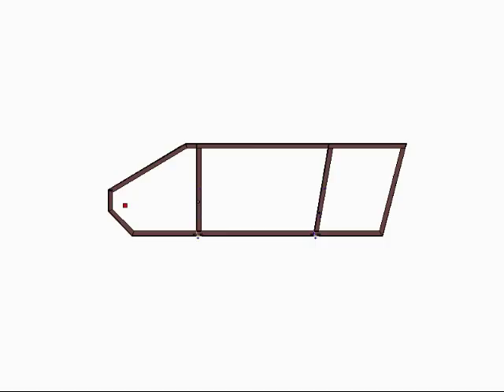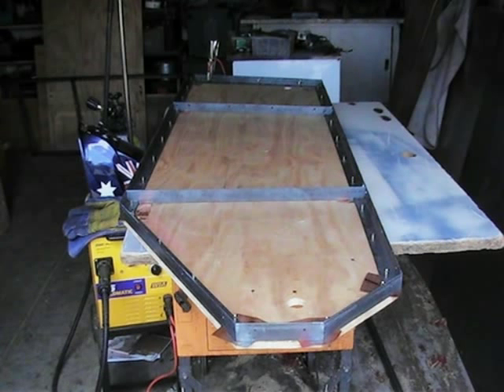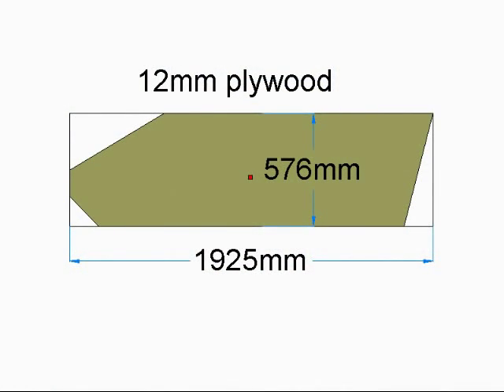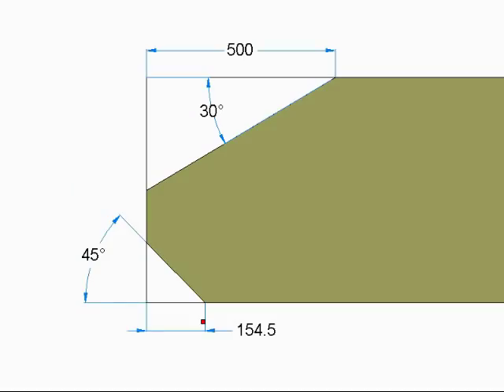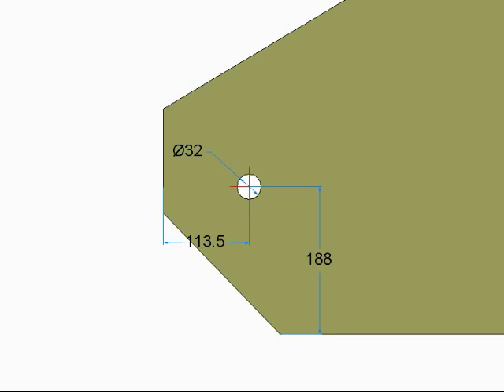In order to ensure that both side profile frames are the same and a mirror image of each other, you can always use the plywood hull profile panels as a welding jig for the frame. The panels are cut from 12mm plywood to the shown dimensions, to form the front and rear profiles of the tank hull. The panels have been truncated as well as having 32mm diameter holes.